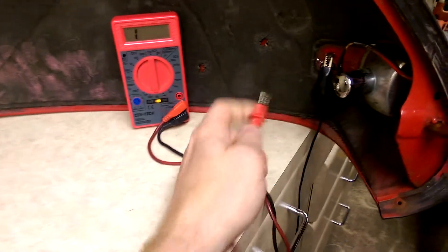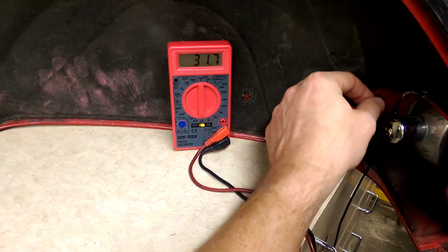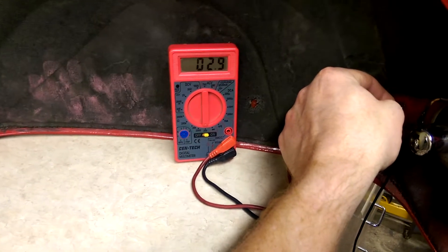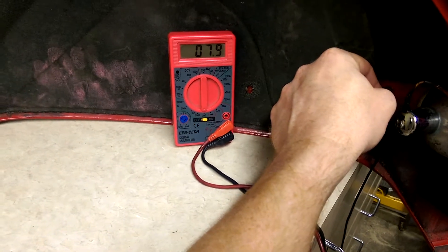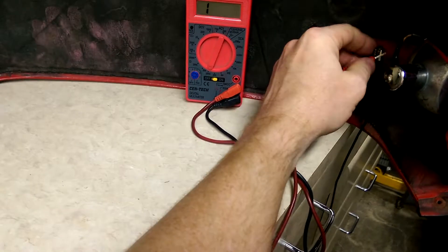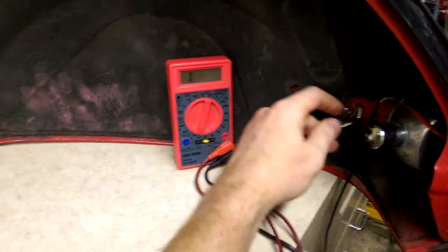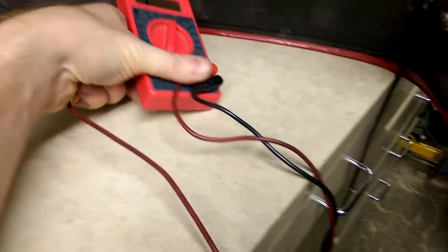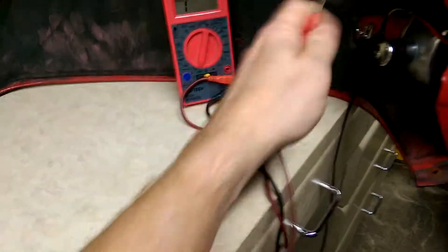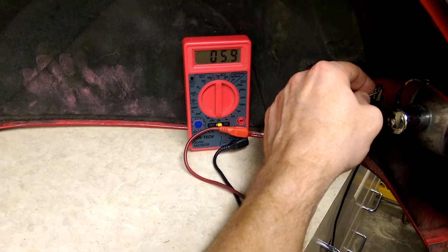Start checking things. When you short the leads together — touch one lead right to the other, that's okay to do — we should get a reading that almost goes to zero. When it reads like this, it's infinity. A good connection should bring it down almost to zero. You just watched me drop this, so it may not be in the best of health — but if I have to, I'll bust out the Heath Kit. This is what most people will have, so I want to demonstrate with what most people have. A fairly low number gives you good continuity.